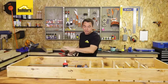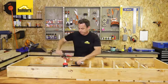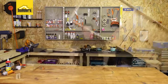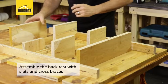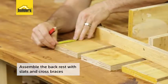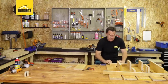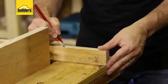What I'm going to do next is the actual backrest — that's not going to be attached to this; we're going to join it with some bolts later on. We're going to be doing our backrest, which is exactly the same process, using the same size spacers. I've got two cross braces here which are 770mm long, and we're going to put those 75mm in from the sides. We're lining everything up flush and square with the edge of the workbench.